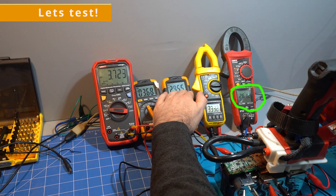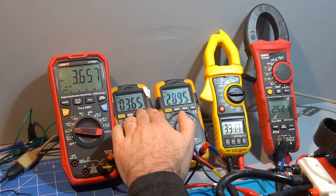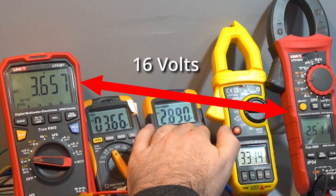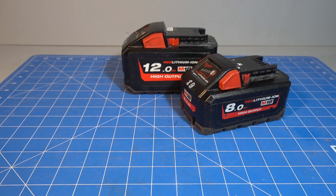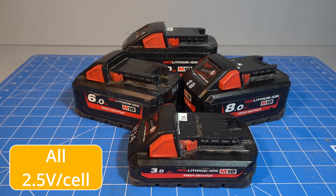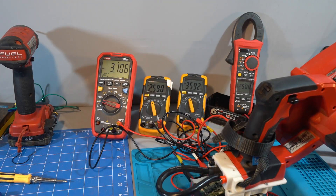This is great news. A basic low voltage cutout would cut power when the pack reached 12.5 volts, but we can see here that the BMS is monitoring all the cells and cuts out as soon as the weakest cell goes below 2.5 volts, despite the whole pack still being at 16 volts. The other M18 batteries with 21700 cells — the 8 amp hour, 6 amp hour high output, and 3 amp hour high output — also cut out at 2.5 volts per cell. The older 6 amp hour, made up of 18650s using the Samsung 30Q, cuts out at 2.5 volts per cell as well.